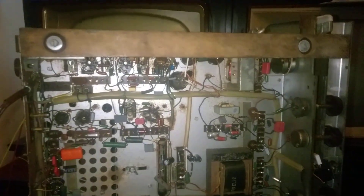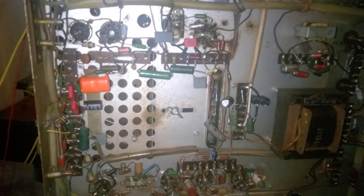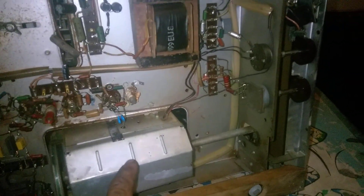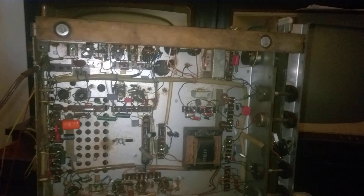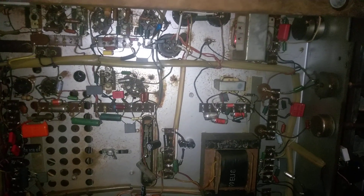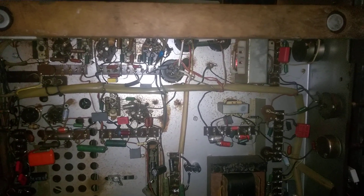There's not much I can do about these little spots of rust. If I repaint certain areas without painting the whole thing it will look miserable, so I prefer to leave it. It won't rot because it won't be left in moisture. I took the cover off and cleaned the contacts on the tuner — and that's pretty much it. It's working really well now. I need to see what that waviness problem is, adjust linearity, do a full setup, and then I will finish the cabinet. See you in the next video.